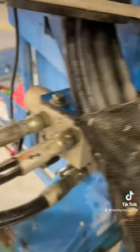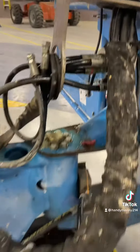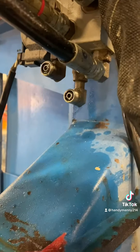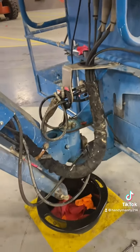So here we got a small manifold as you can see. Now this one right here handles the jib. What happens is you got your fluid coming in through here — I'll navigate through the hoses — rotate jib, platform level and whatnot. So what I did is I took my main feed and return hoses and I put them straight to my rotator.